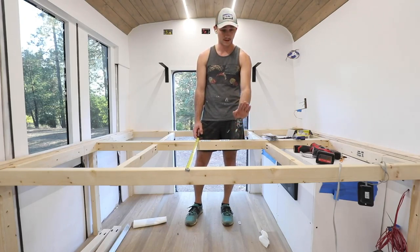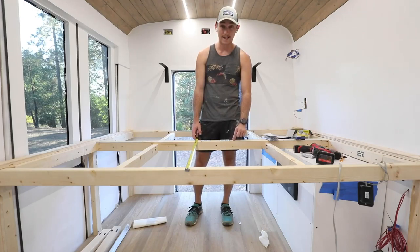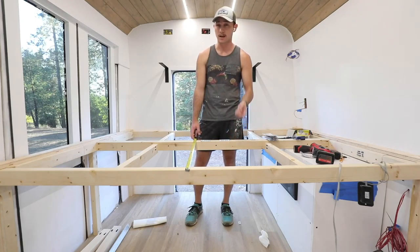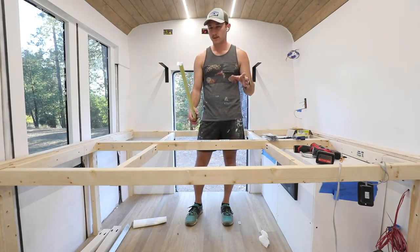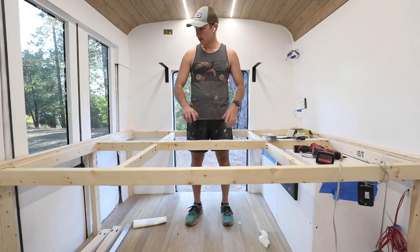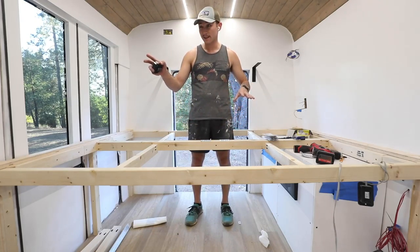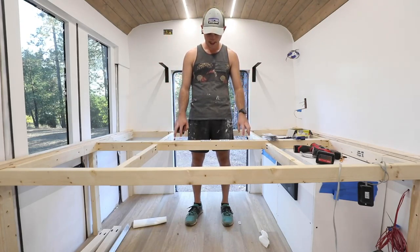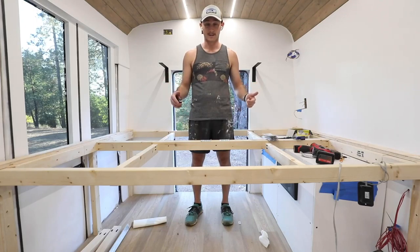I really don't need to lift more than about 45 degrees. However, I do need enough space in this gap to allow each side to lift up without its own plywood bumping into the opposite side. We'll see when we get there how that could be a problem. I'm gonna do some measurements then some cuts and see what size piece we get to fit in here. Hopefully we nail it spot-on and don't have to waste wood.